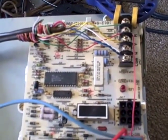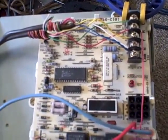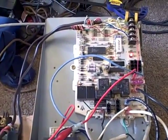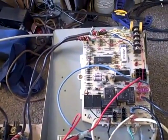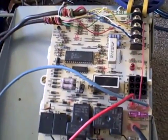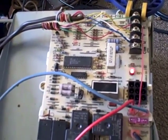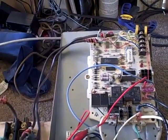This is kind of a handy board — I might be able to come up with some other testing ideas. Heat wiring is kind of the same way. If you have low voltage issues with the heat wiring, it could be any number of things — gas furnace control board shorts or a thermostat issue. On electric air handlers, if you have some sort of short on a heat call, open it up and look at all the sequencers. Sometimes you'll have melted high voltage wiring on the sequencers that falls down and hits the low voltage side, or someone had just miswired something off-season and didn't find out until winter rolled around.